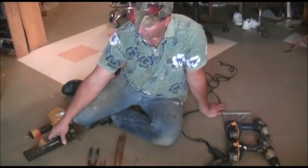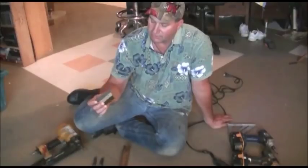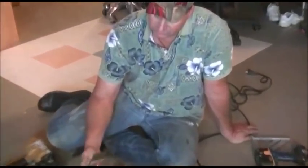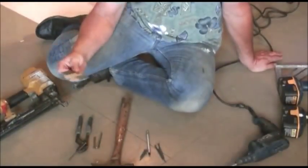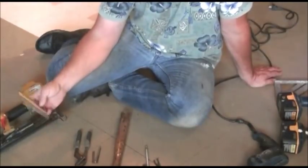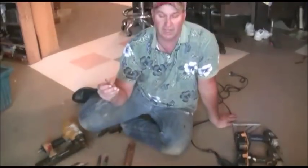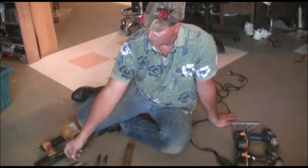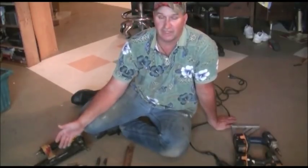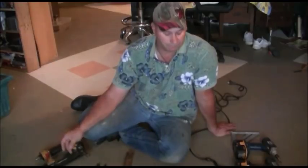This particular one is a stapler, but there are straight nails and there are angled nails. Again, you want to use the same principle as the longer screws for the framing: the 2.5 to 3 inch for the framing on your air nails, and it could be straight, these are angled nails, and the 2 inch, 1.5 inch on the plywood. There's a number of different brands. You can use any of those brands for nailing the plywood and nailing the framing for the plywood.